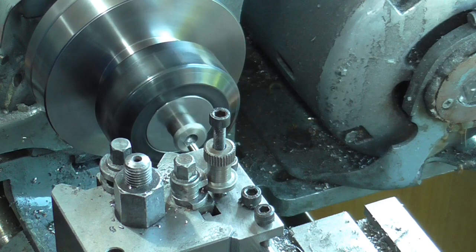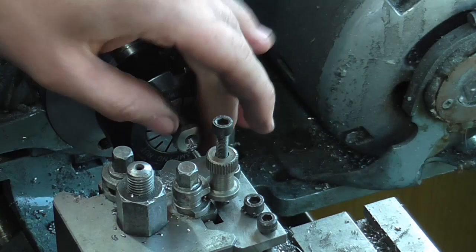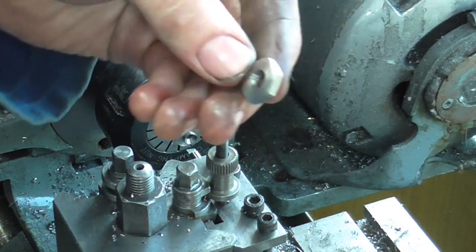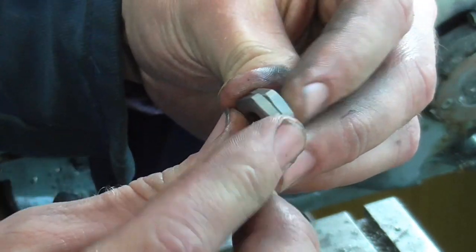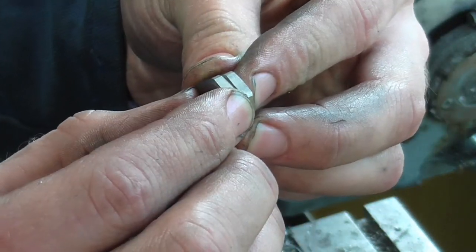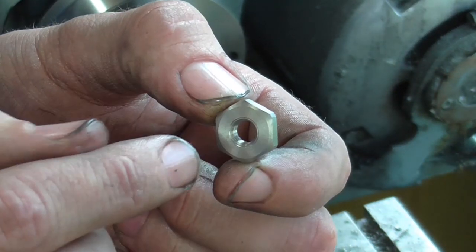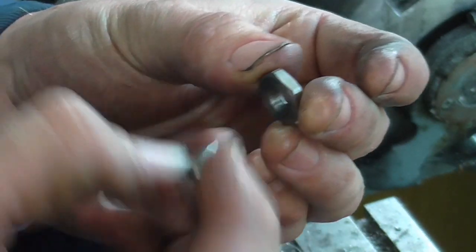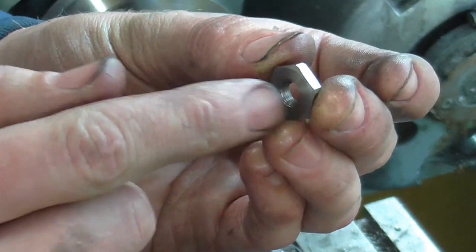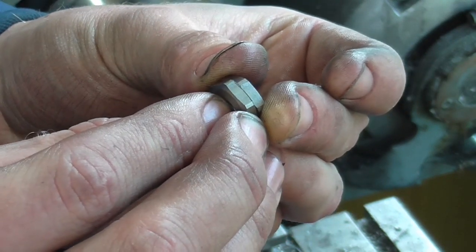The final thing I'm doing to these nuts is putting in a counterbore on one side of every nut. When the two nuts come together I'll assemble counterbore side to non-counterbore side, which will improve the mating nature of the two faces. Because these nuts are so thin I've had to put very shallow chamfers in, meaning that at one section of the bore the thread almost comes out. As you tighten them together repeatedly, that bit of thread can start to pull out, and if there's no relief chamfer or counterbore big enough to contain it you can affect how the faces actually mate.